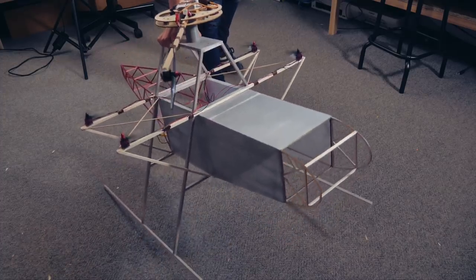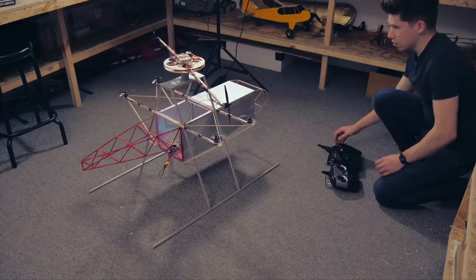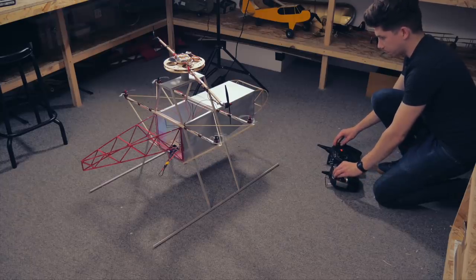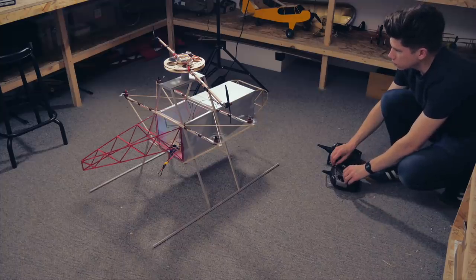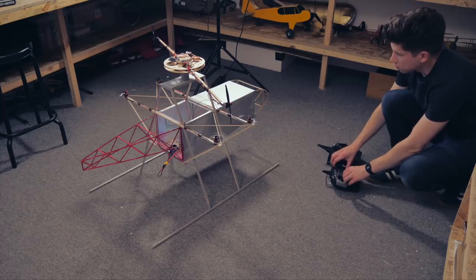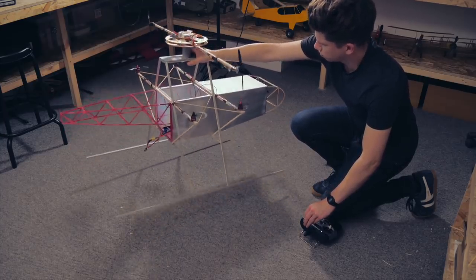The next problem I had was when I was testing the motors. When bench testing with the props off, I experienced a common problem with multi-rotors where the motors would throttle up gradually on their own. I think I might have just discovered a fatal flaw with this whole principle of putting quadcopter rotors and a flight controller on something with as many vibrations as this helicopter. It seems that when the motor vibrates, the flight controller reacts and all of the oscillations build a resonance, and therefore the motors start to accelerate — a common thing that happens with quadcopters. I messed around with some settings but ended up getting the same problem with the props on in quite a dramatic way when I increased the throttle to anything over idle. Thankfully, the phantom throttle-up problem was not present when the aircraft throttled up independent motors during controllability testing. I set up an arm switch which could kill the motors if anything went wrong, so I was being safe. If you're a multi-rotor expert, feel free to comment down below and tell me what I'm missing — I'm keen to learn.